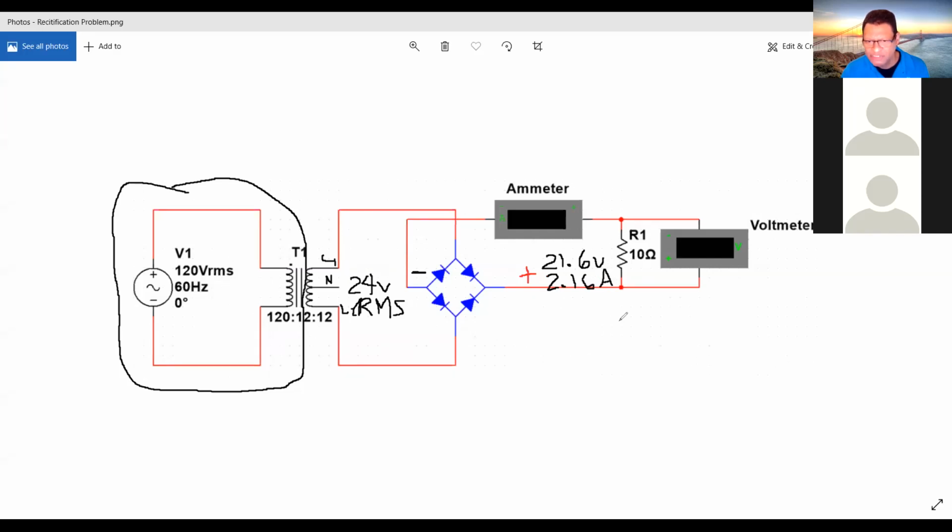There were 2 other questions there, and I was also asking for the peak voltage of the DC rectified voltage. So remember, please, that this is a signal with full wave rectification, but it still has a ripple voltage and it still has a peak voltage right there. That voltage right there is not 21.6, it was 30 volts. How do we find that voltage? We take our 21.6 volts, which is the effective voltage in this case, and we divide by 0.707, and that would be equal to 30.55 volts.